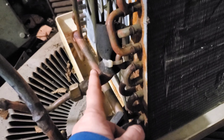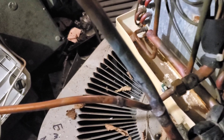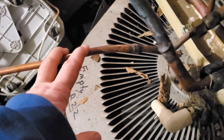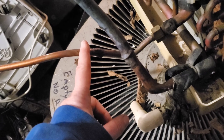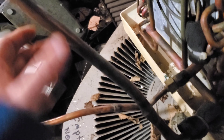I'm going to cut this brass off here — brass and brass. Some of this is number one, so I'll sort through it after. I'll cut all the copper up into number one and number two. For those who aren't scrappers: from here to here is number one because there is no solder. Some yards won't take it as number one because coolant runs through the stuff, but mine does not have a problem with it. Check with your yard — they may call it number two if there was oil running through it. For me, I just cut that piece off where the solder is, and the rest of this is number two to the brass piece.